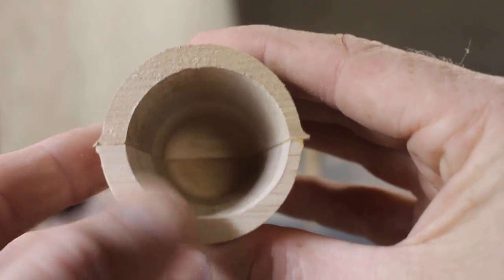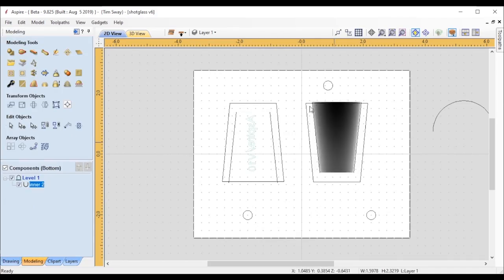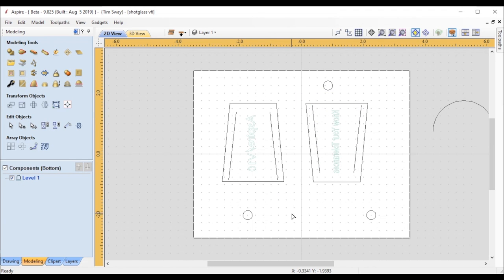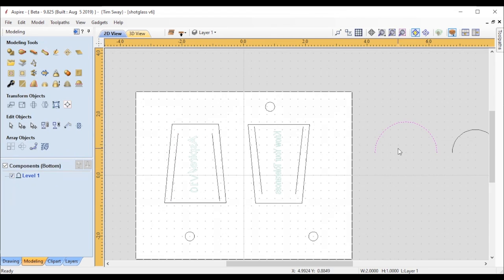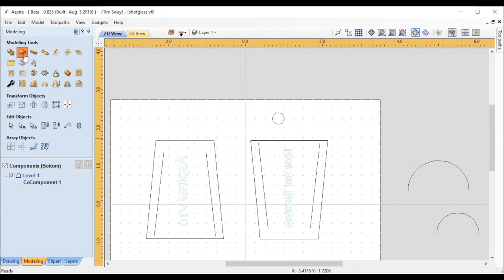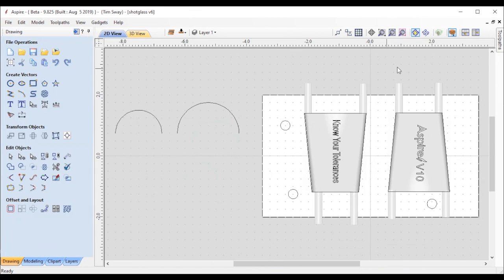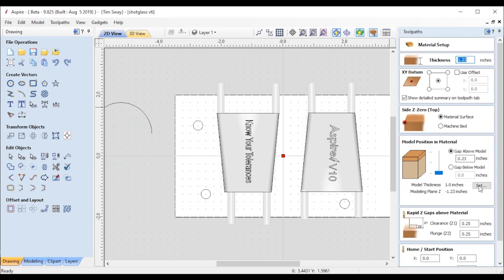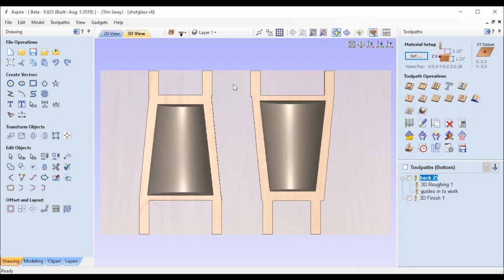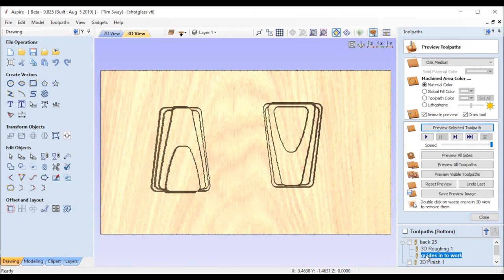More importantly, when you look at the round surface on the top it's not even - it's about two millimeters more wide on one side than the other, and I'm not quite sure why. I think what's happening is that during my finishing pass the machine is actually pushing the wood down and it's bowing a little bit - coming down further on one side, and on the other side it's under release and coming up. I thought the best way to fix that would be to add support at the top of the cup, so I took that interior dished-out path and modified it so I didn't carve all the way to the top - I left about five one-hundredths of an inch lip on the top of each side. That helped quite a bit but it was still a little bit off.